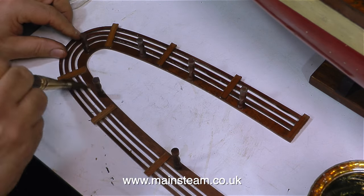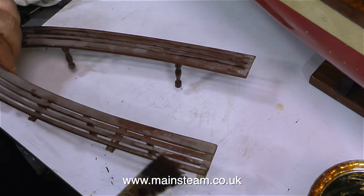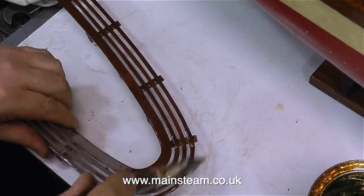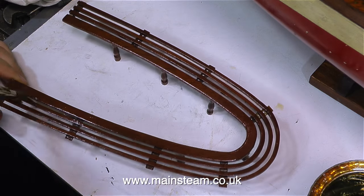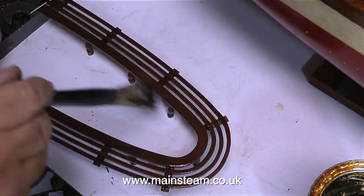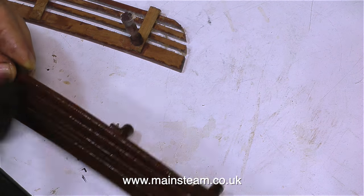First of all I stuck back the leg that was missing. On the front part of the seating there's a leg missing entirely, so we'll have to make one — I'll show that in a future episode. In exactly the same way as the deck and superstructure parts, before varnishing I gave them a light rub down with some Scotch-Brite. I didn't want to use sandpaper as that may have made the parts look patchy once overcoated. When I varnish parts like this, I tend to varnish the underside first, followed by the top side, then I revisit the underside to remove surplus varnish so it doesn't look like the part's been painted with a tar brush.